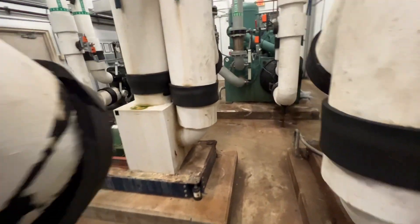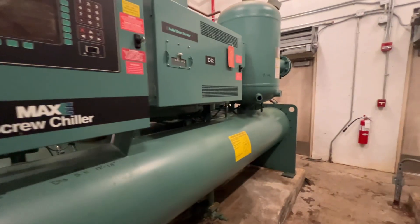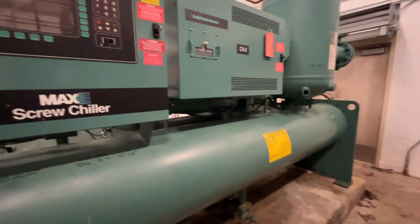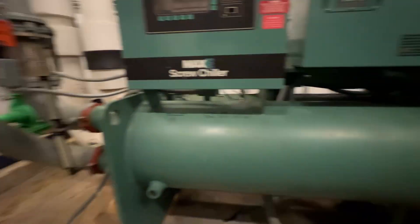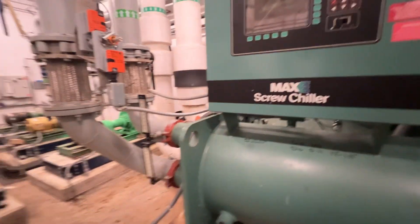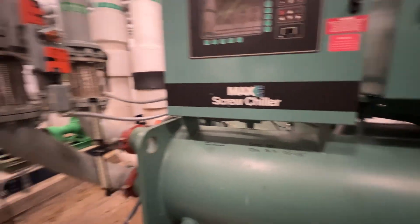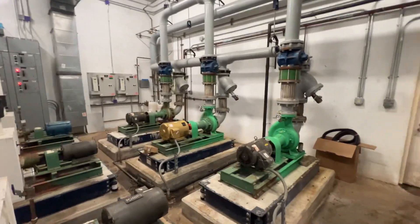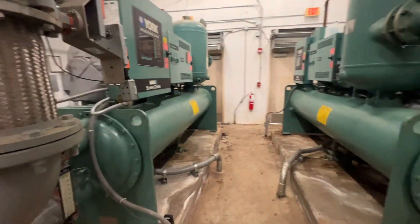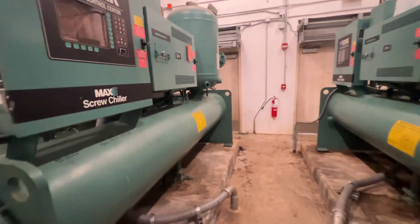In a nutshell, that's the plant. Big compressors — big air conditioners, basically. We're using the water as refrigerant. The chillers have their own refrigerant, and we're just transferring heat from that water to this water, back out to the tower, and over again. It looks overwhelming, but the more you see them the more you get used to them — it's pretty basic. To cool off large buildings, you need chillers.